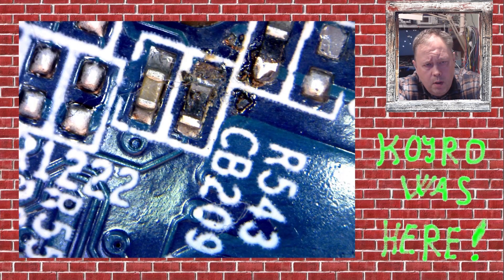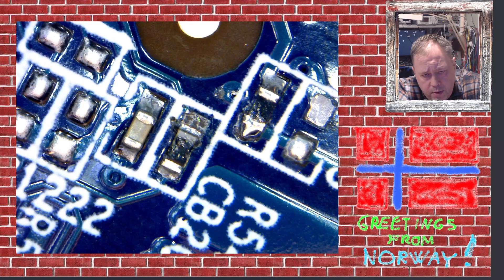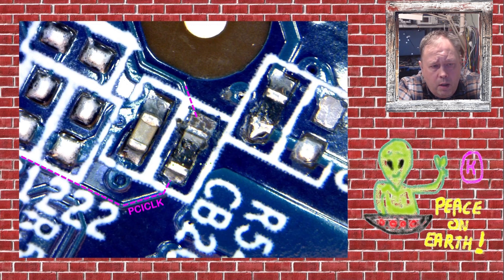After the last video I was experiencing some instability with my fix. When I desoldered what I had done, I saw that I had actually ripped off part of a resistor — this is where the signal goes into the chip. After cleaning up, I saw I had damaged some of the pads. I measured out the resistor and it appears to be a zero-ohm resistor, though I'm not entirely sure given how I had mishandled it.